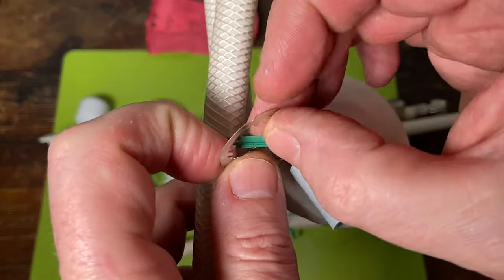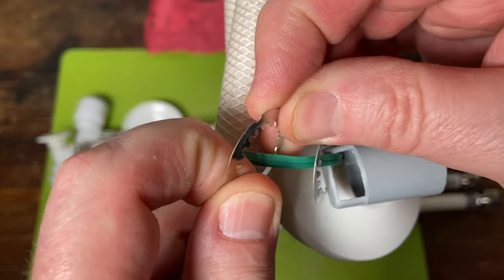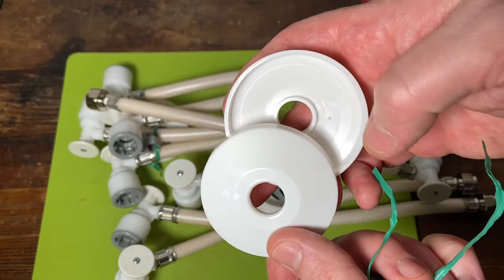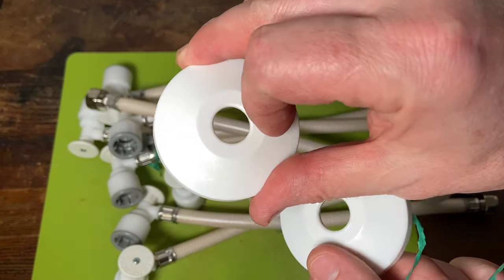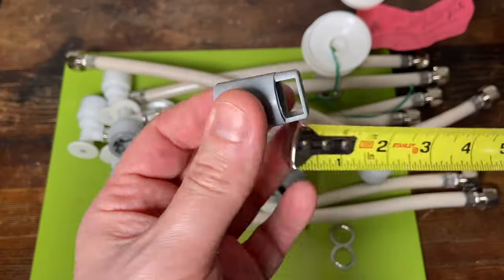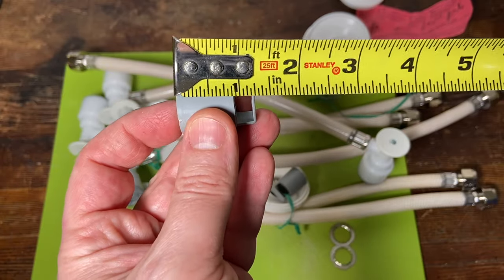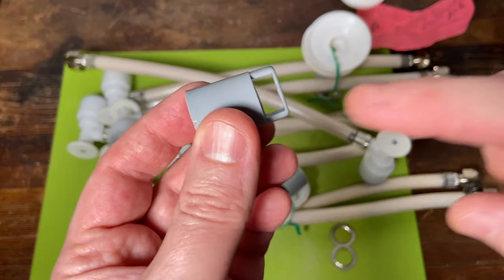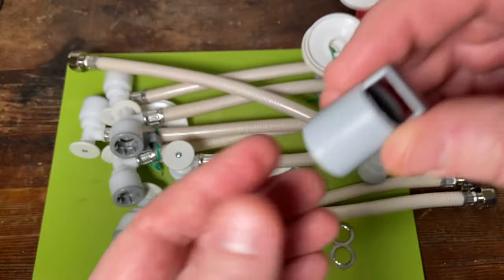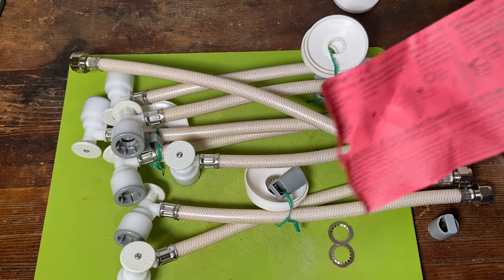This is the kind of ring that's in there — it's kind of a one-way thing. You put it on there and you can't pull it back the other way. We've got a couple of plastic escutcheons for these; you can put them on over it or give it a slice and pop them on afterwards. They say they want the pipe pushed on an inch and a quarter, and this is exactly an inch and a quarter — they want you to push it the whole way until you actually see pipe sticking out. You're not installing it anyway.